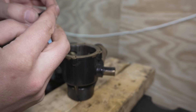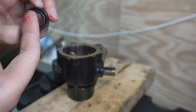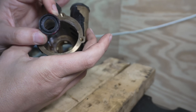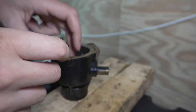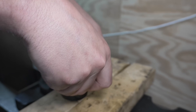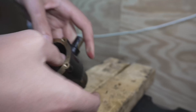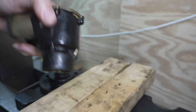I'm going to take a tiny bit of grease or oil — just something to lube the outside of this seal. Keep in mind we're going to install this with the open end, with the little metal ring down in there, facing up. So it's going to go in from this direction. I'm going to set this thing down in here and see if I can just push it in by hand — I got it started but we might need a little extra push to get it fully seated.